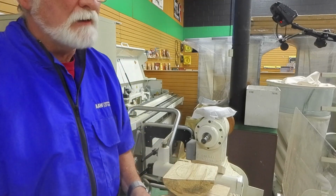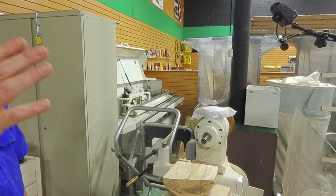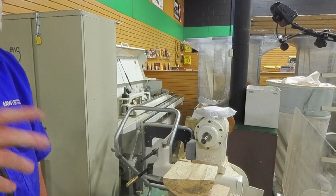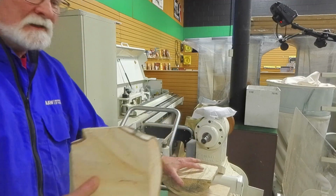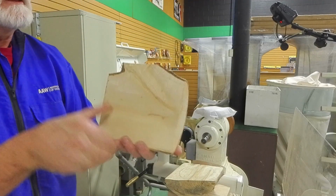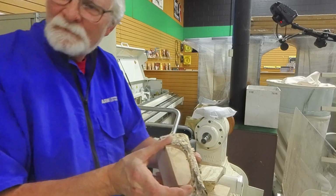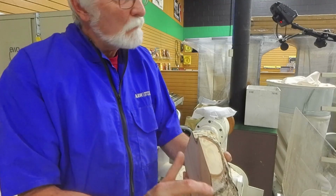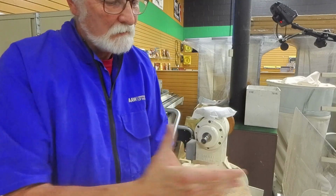And what you see in one of them is the feather grain that you get by splitting where the branch is. And that's super important. That feather, you gotta cut the branch the right way. So here's a piece of wood. The big branch comes out here. So you split it lengthways through the branch. If you cut across this way, you won't see that feather pattern.